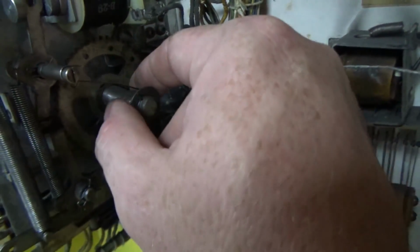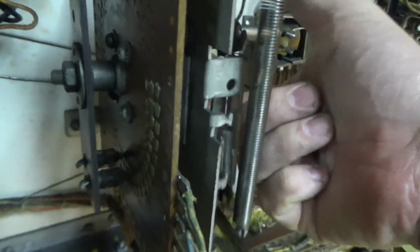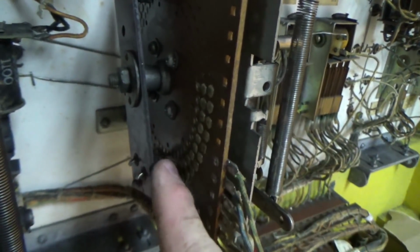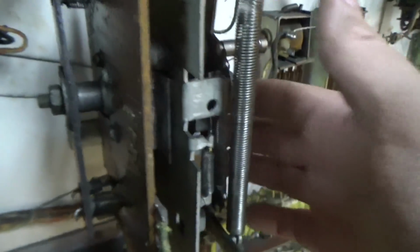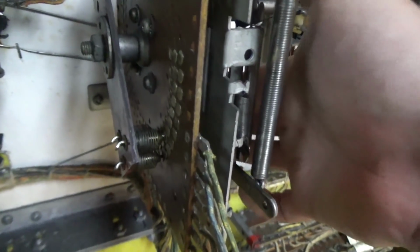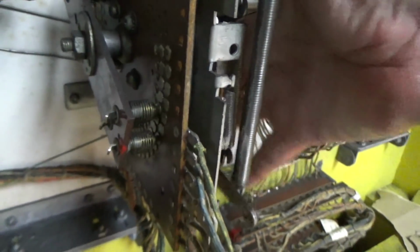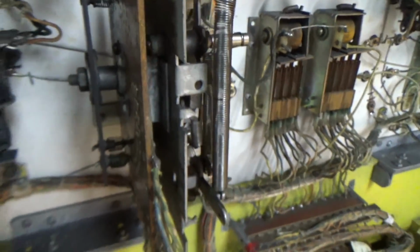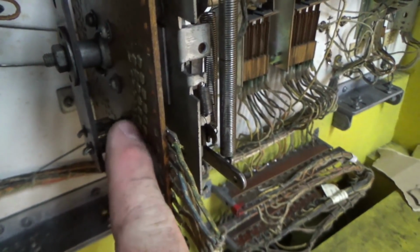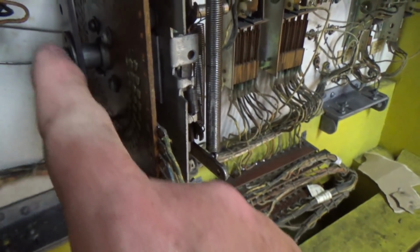There is like a clock spring here, I guess you'd call that, that's winding. And so you want to make sure that, sure, it'll reset all the way from the end, but will it reset from halfway? Because it could be that there's not enough tension. Or, I shouldn't say tension, because then you'll start messing with the spring. Don't change the spring, people. Leave the damn spring alone. It's never the spring, people. It's dirt.